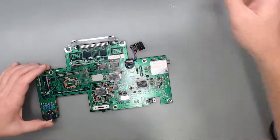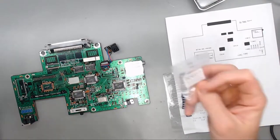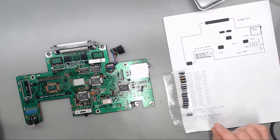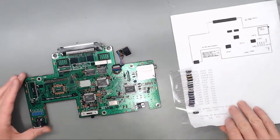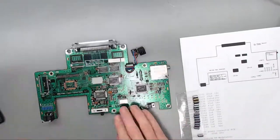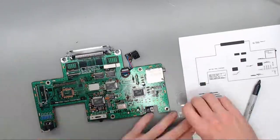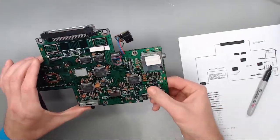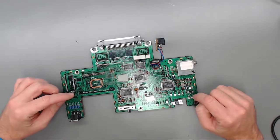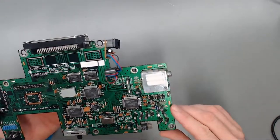Put this lid off to the side. These capacitors come from Console5 — they only source high-quality caps, and those are the only cap kits that I put in any consoles that I refurbish. I'll begin putting all the capacitors back in using this capacitor map here. Once we have all our capacitors in, we'll double check and make sure that polarity is correct on all those caps, then go ahead and start getting them soldered in.